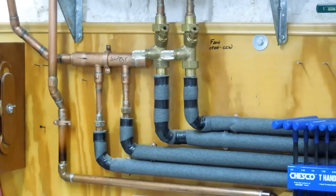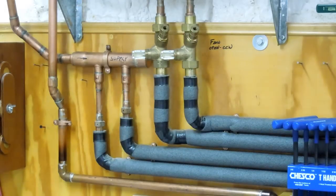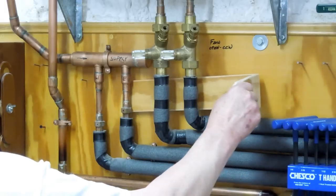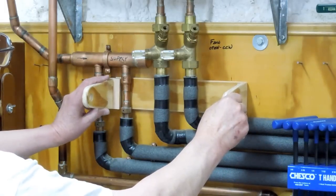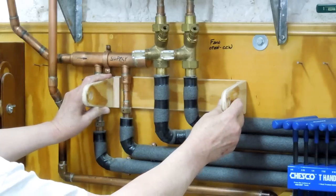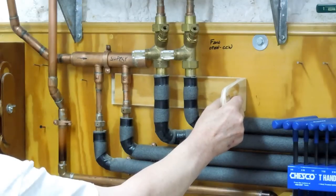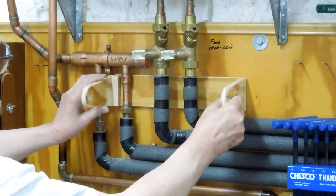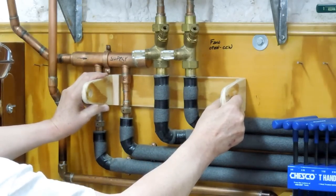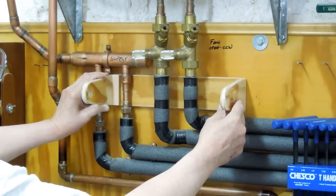I have another area in the shop which really isn't usable for anything else, but I still could have the occasion to have to work on this piping. So I'm reluctant to put anything up here permanently that I can't remove. If I put this up here and glued all these pieces in place and the dowel in there and then had to work on this piping, I'd have to break it and get it out of there. So this piece will screw to the wall, this piece will be screwed in place, and the wood dowel will have a fender washer on one end so I can take it off.